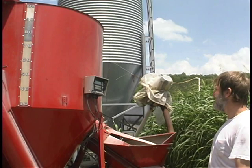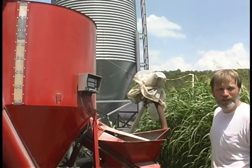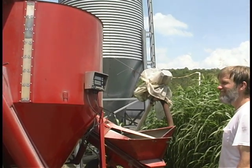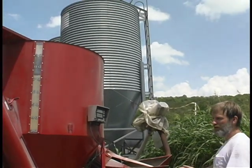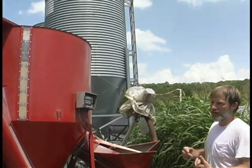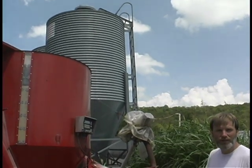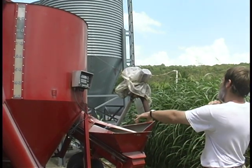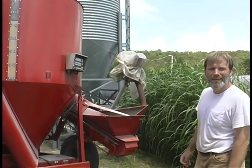It's predicated too on the dispense rate of your auger on the bins, because sometimes this is pretty slow, so you're waiting around for all 1,000 pounds of corn to come out. And of course, I'm just now starting to factor in the fuel, as I know about how much diesel I'm using per ton, because it operates from the tractor. Yeah. You need this size machine. You need at least, I think it's at least a 50 horse PTO.